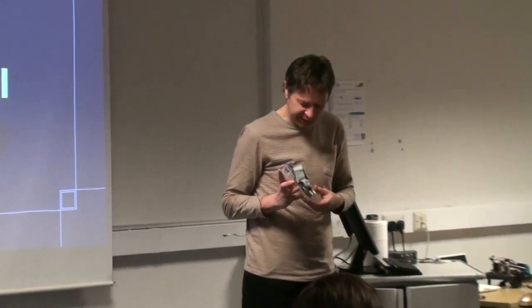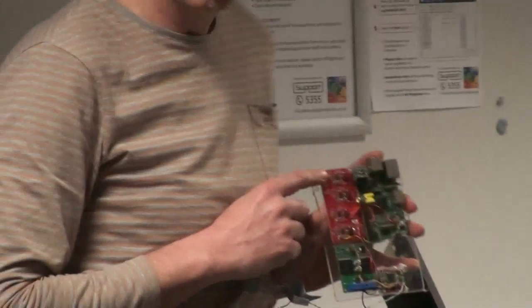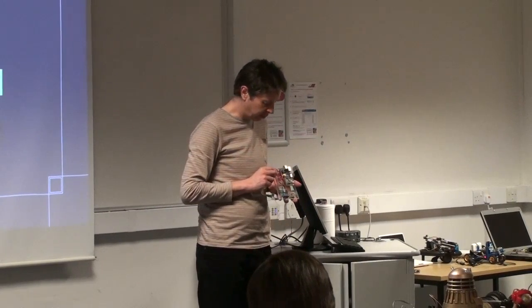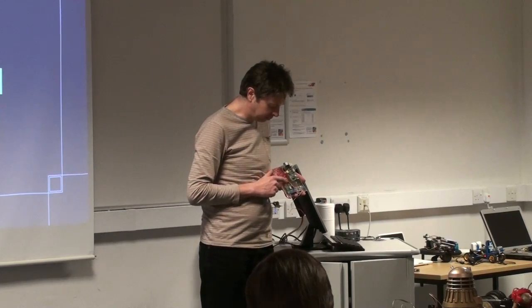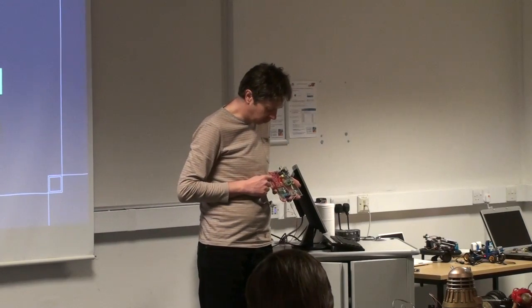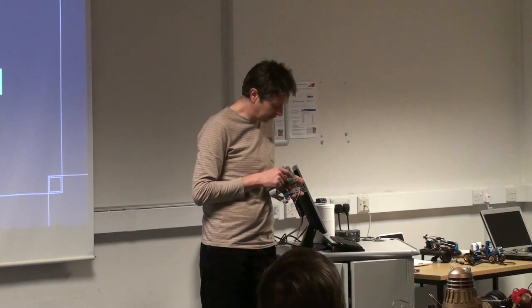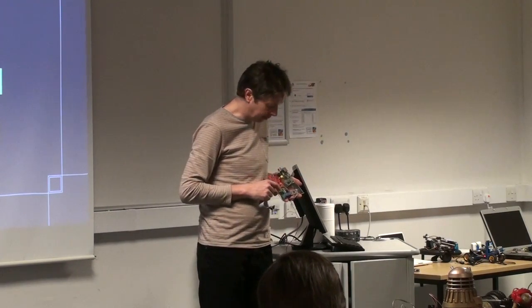This is the Raspberry Pi that I have here. I'll just unplug that so you can see it easily. What I've done on this one — I wanted to run a robot chassis on a battery, so I've taken off the linear power regulators on the board and used some switch-mode regulators from a commercial power supply board. That whole board is fed with 12 volts and supplies all the voltages: 1.8, 1.5, 3.3, and 5 volts to the board.